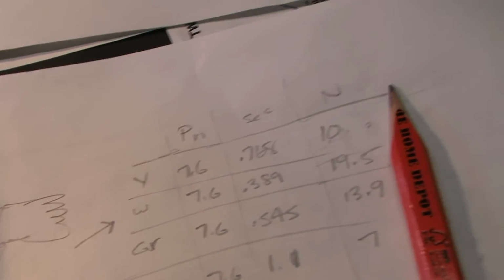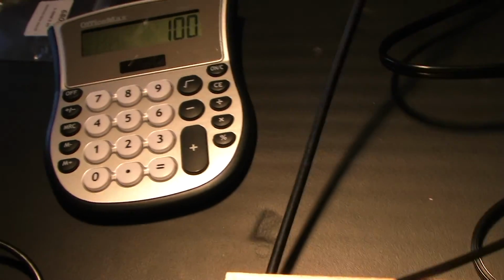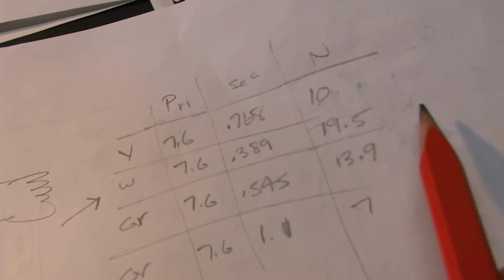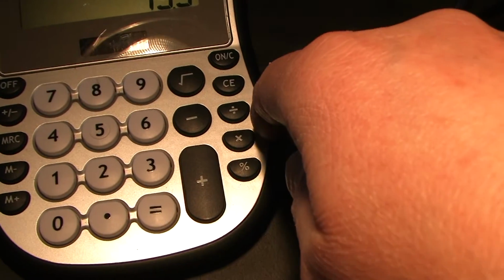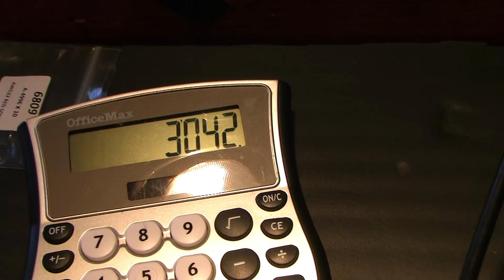and that would reflect an 8 ohm load back by 10 squared, which is 100, times 8 of course is 800. So that would reflect it back as 800, but I need 3K. So to reflect 3K, 19.5, let me see what that gets us. 19.5 squared, there's no square button, times 19.5 equals, times our 8 ohms, that's 3K. We need the white tap.